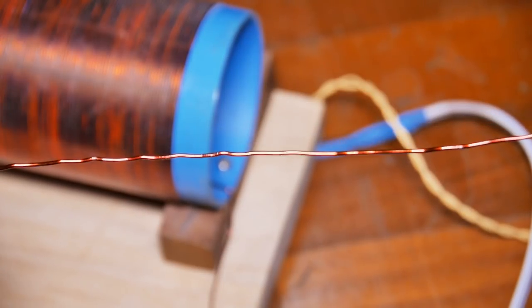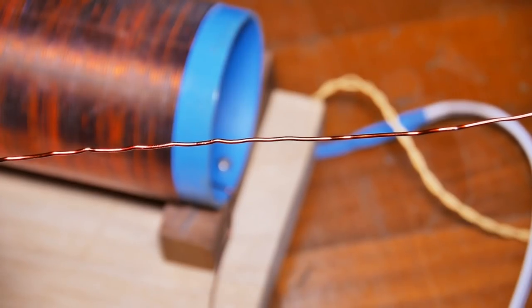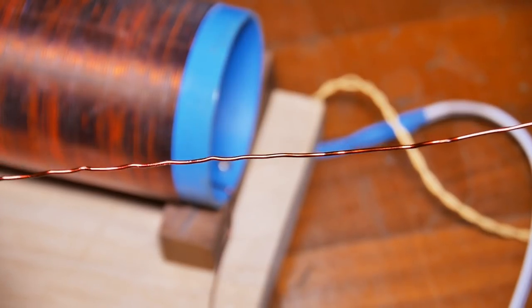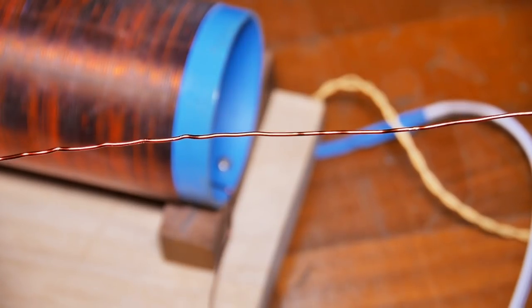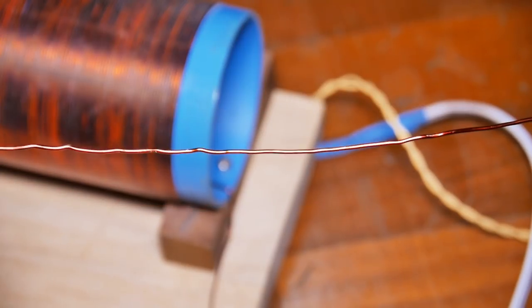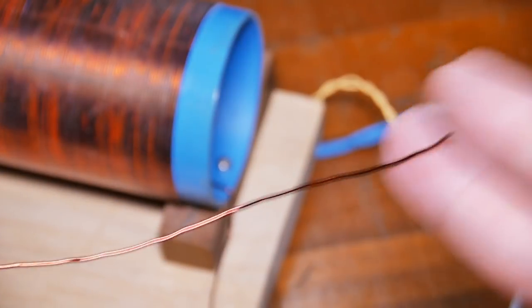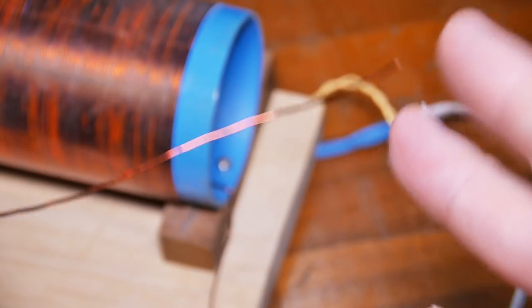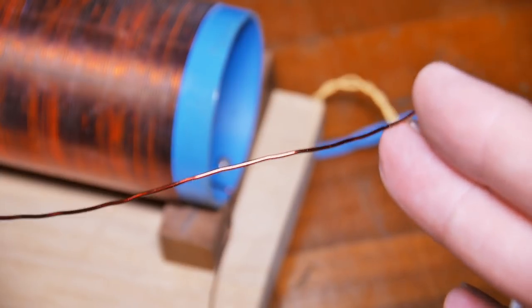I just use a plastic string, and make sure you don't run it near anything. Especially, for safety reasons, never run it near any electrical lines or anything, but run it out into free space and secure it on each end with, say, a plastic string or any kind of plastic bobbin, something that will keep the end of the wire from coming in contact with anything at all other than the plastic. So, yeah, the antenna is extremely important.